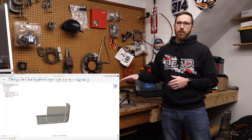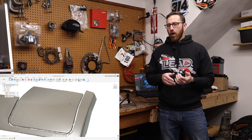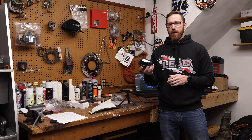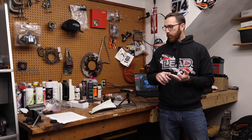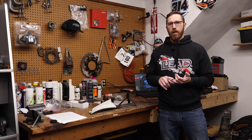It has RGB color capture, so in IR structured light mode you can do color captures — I've tested it on a few things and it works pretty well. There are a couple of different scan modes. There's no dedicated turntable mode like in the Metro series since the turntable just powers on and starts spinning. You do have global markers, marker tracking, and feature tracking. Keep in mind that laser scanning requires markers — either global markers captured beforehand or marker tracking on the fly. Global marker and marker tracking also work in the IR structured light mode.